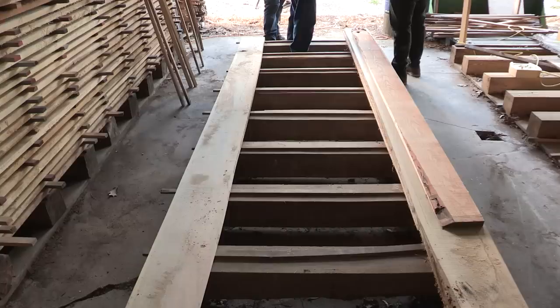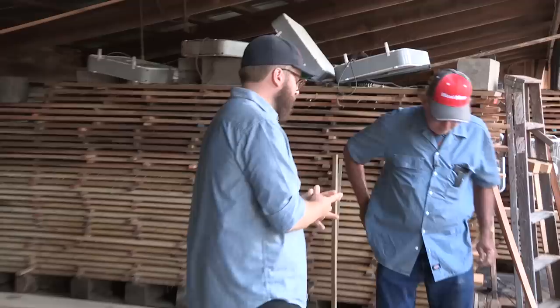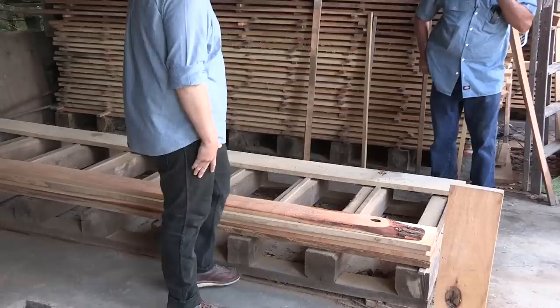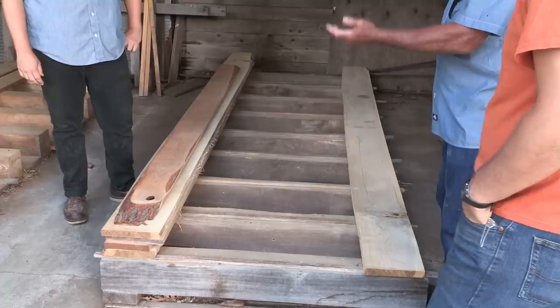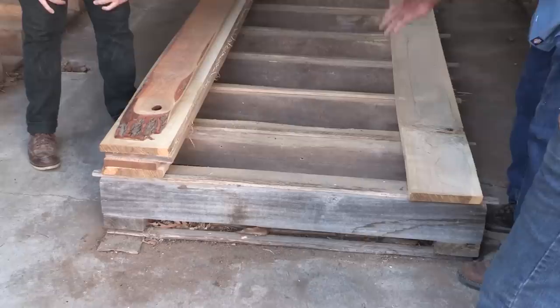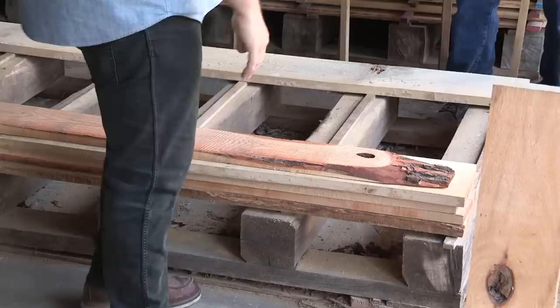So we're here in one of your drying areas and we've got some stacks of lumber here, but I understand that stacking lumber in the correct manner is really important too. Absolutely. Stacking lumber — the first thing you need to look for is a good, sound foundation. We happen to be in a repurposed ag building here, so I had cheap concrete to work with. I have six-by-sixes — they could be bigger, particularly if you're outside — so you're up off that rainwater splash area. These bolsters underneath here, this footing is all tied together so it stays square, and I'm on about 18-inch centers here.